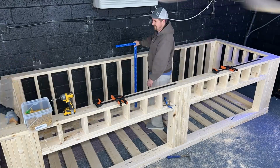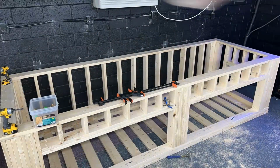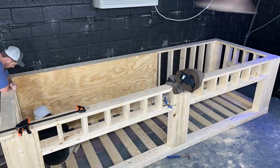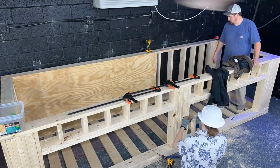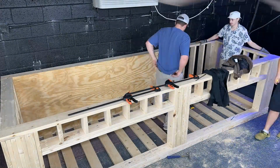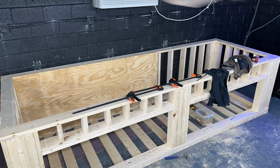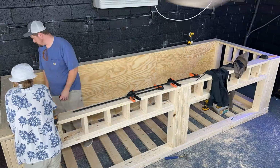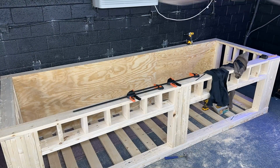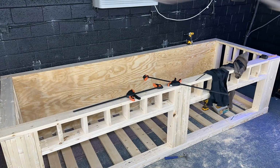While we're building these pillars, you can see that pillar that's there in the middle of the viewing panels and on each corner of the tank. There are screws holding every single 2x6 together, as well as longer lag bolts holding every 3 boards together, as well as 10 and 12-inch wood lags holding multiple boards all together from every angle possible. You want to make sure when you're playing with this much water weight that you have a strong tank.